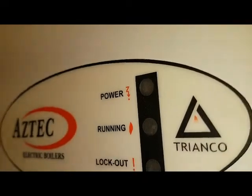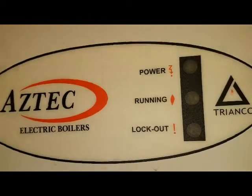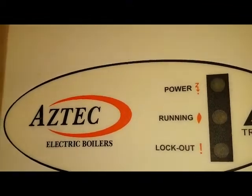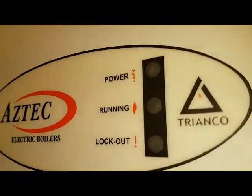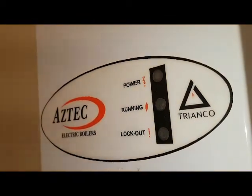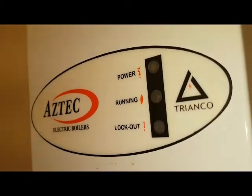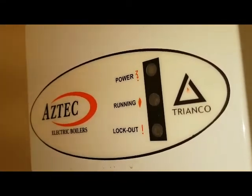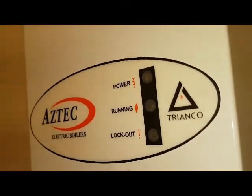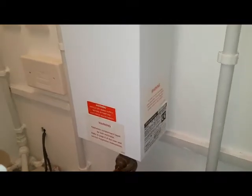Can you hear that pulsing noise — that hmm hmm hmm hmm hmm? That pulsing noise is the board. It's stuck on the board, just stuck — there's no lights on. If you ever hear this pulsing noise on and off, you sometimes get this on gas boilers as well, on the ignition board. It's just pulsing on and off. All the circuit board has gone on it, so it's going to be a big job. We've got a video on this.